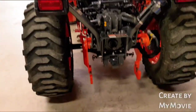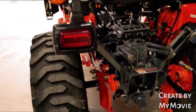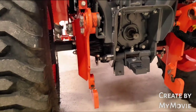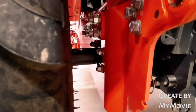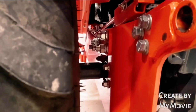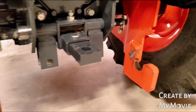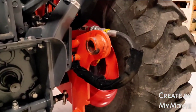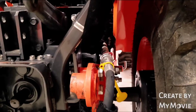Start with these ones here — pull out, there's a washer here you don't want to lose. Pop those out and slide out. Like I said, always stick your pins back in the implement you're taking off unless you're going to use them on another implement. Stick the pins back in there so you don't lose the bushings. Now we've got the three-point off the back of the tractor. If you get a backhoe with your tractor, you'll need a subframe as well. On these B-series tractors, the subframe is bolted in right there and goes up and around the axle.